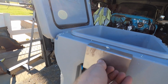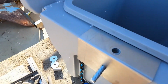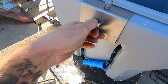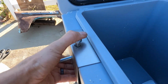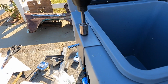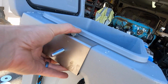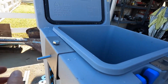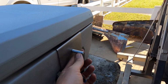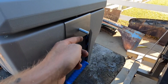So if I slide this on here like so, you can see that the hole lines up, your hard bar goes through. It worked out that the head of this doesn't interfere, and then you zip it on down. I don't know if we can do this one-handed. Look at that, like a pro, baby. See? So bolt it through, and then this will be welded. So let me make sure that these are the size. This is the size hardware I want. I think this will be fine because I need a sideways piece. So we can just weld the tube to tube.